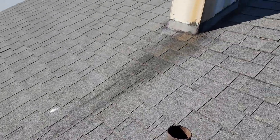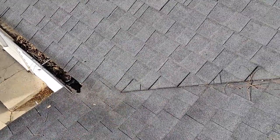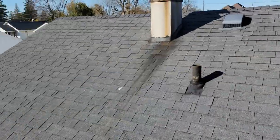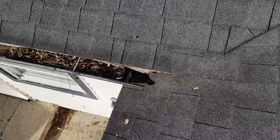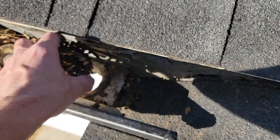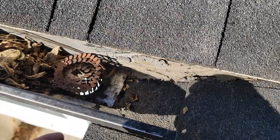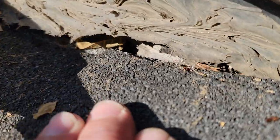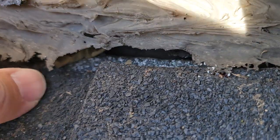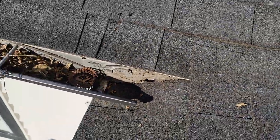Here's the crazy part. When I was here, there was also some damage down here. It looks like somebody had pulled apart this valley and this section of the roof. Let's look at this nice little surprise — somebody left a coil down here. I don't know if they intended that as a gutter drain block or what. But look at the roofing quality here: there's a gaping hole with no flashing. It just goes down to the soffit area down there. There's nothing there but caulking.